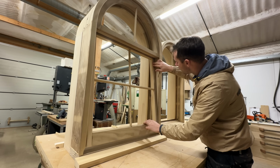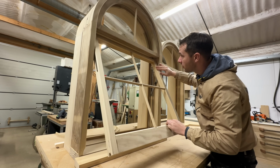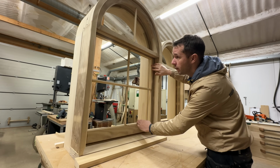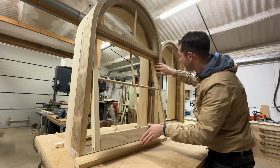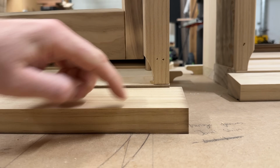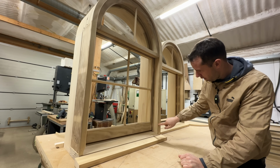And with the hinges, the sash just about tucks under that top sash. I've got to take a tiny bit more off that, because it's still catching a little bit, but it's one of my jobs to do before I finish sanding these windows. And then, like all my other sashes, got a little relief cut there so any water that gets behind and rains on the sill doesn't get trapped behind that rebate there.